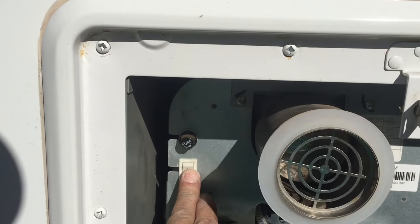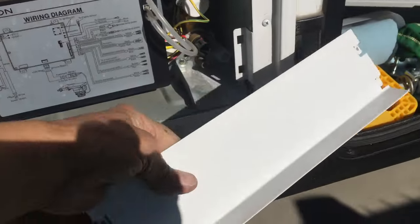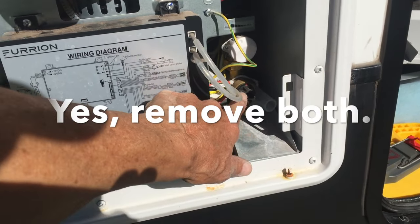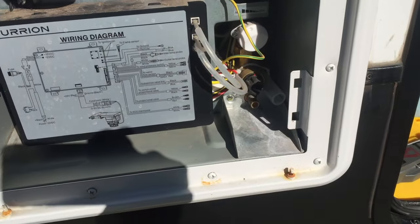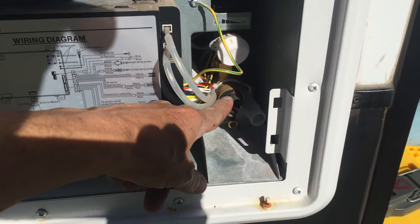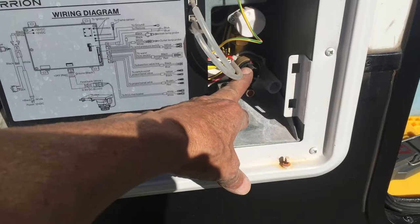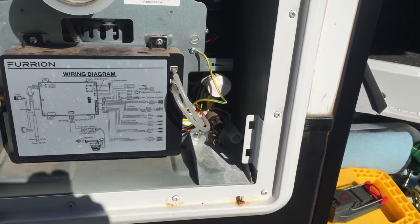This is the power switch — making sure it's off. There's a drain plug right here, and this one has a filter in it. Take it out — it's in there pretty tight so I may need tools. Clean the screen if there's any grime on it. Blow everything out and then put it back in. After antifreeze, remove it again to confirm antifreeze made it through.